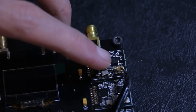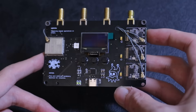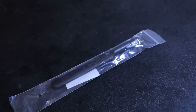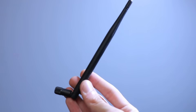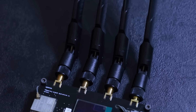The antenna setup is much more flexible in this new version. This time I used four IPEX extension cables to connect the nRF24 modules and the ESP32 to external antennas. For the antennas themselves I went with 8 dBi models. There are other options you could use, but I chose these for a good balance between size and signal gain.